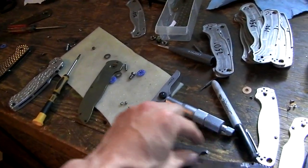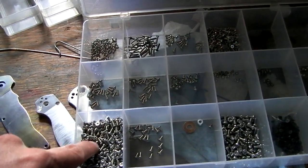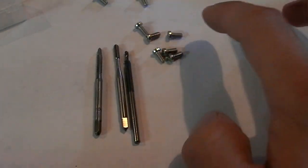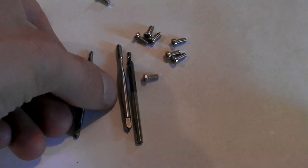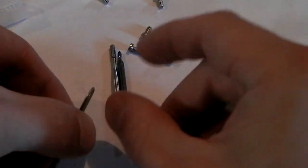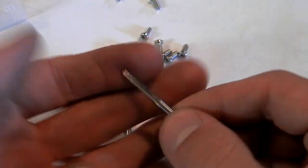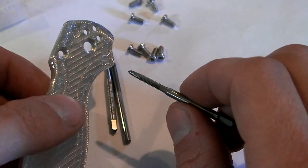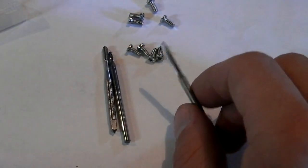I think I've got enough — it's nice to have everything organized. So here I've got three different ways for making threaded holes. This is your conventional 4-40 tap — 4-40 is the thread diameter and pitch by the way. This is a taper tip tap; you can see how it kind of tapers down, it's a really long tip before the threads actually start — your threads don't start until about there. So your hole either needs to be a through hole where the tap can go all the way through the back, or if it's a blind hole it has to be quite a bit deeper than the threads. So it's good for through holes, but not good for blind holes, and I like doing blind holes sometimes.